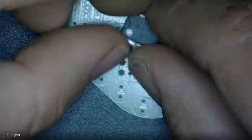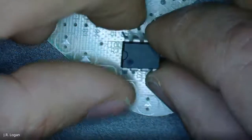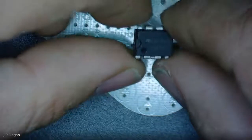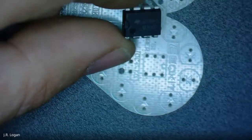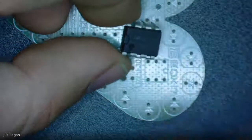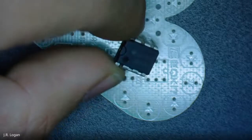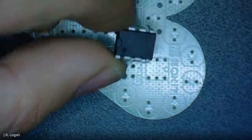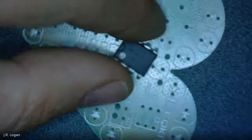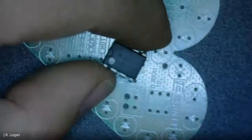And then an op amp, this is actually a whole set of components within here. It is doing something similar, but to my understanding it's delivering scaled amplification. The more you put on an input, the more it's going to amplify out of one of the other pins. So there's a relationship between them, and there's going to be a low threshold and a high threshold where those don't work, and that's where you look at the data sheet to figure out what's going to work for you.